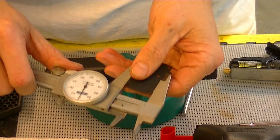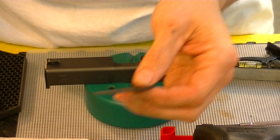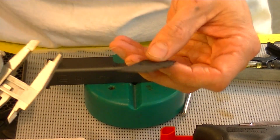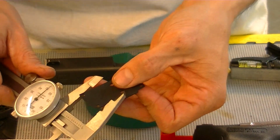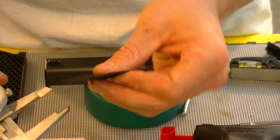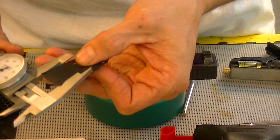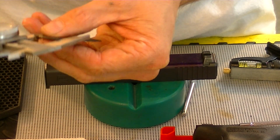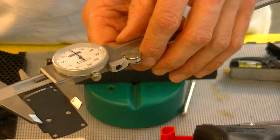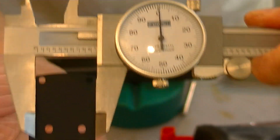All right, to set up for markings and everything, measuring this plate. This plate's rigid. It actually has a gasket, which is flexible. It comes with it, and then a more rigid plate. And to get a measurement on this plate, you want to make sure that you don't have it angled one way or the other. To do that, the easiest thing is to get it long ways here. And we are at an inch. Let me get this turned around here. We're at an inch exactly.